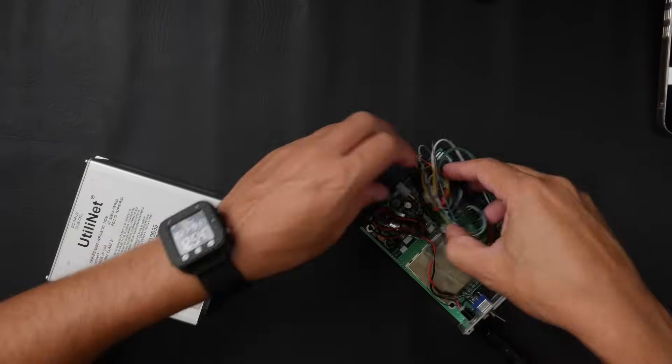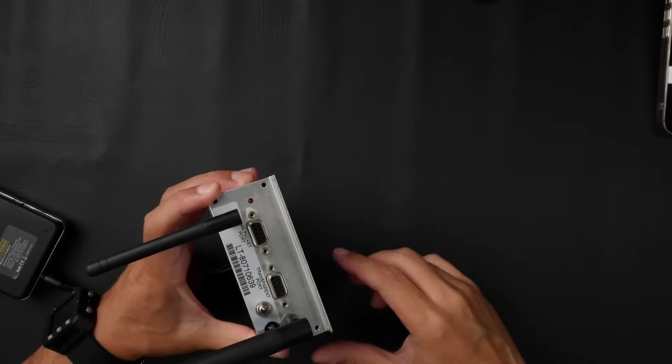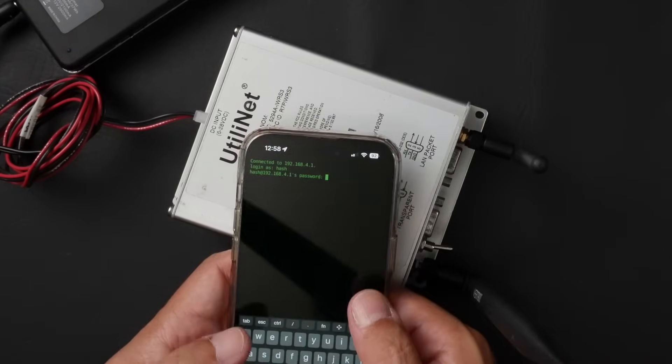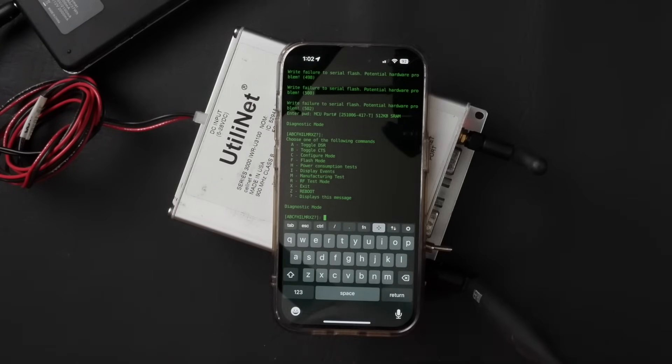It won't be able to connect because I have the transmitter turned off. A red blinking light means something's going on. Now what we're looking for is a network to pop up — it'll say Utilinet. I named the Wi-Fi that because it's easy to find. There it is. And don't be looking at my password — it was 'password' by the way. In here is the configuration menu that allows you to change anything in this modem. It's accessed by controlling one of the pins inside, and by doing that through the Raspberry Pi, I can basically use this device wirelessly from my phone anywhere. Let's take a look at the smart meter network and see what it's doing around here.